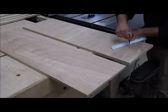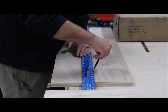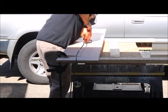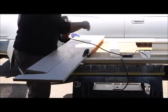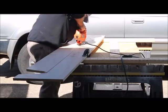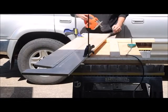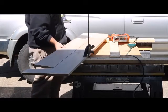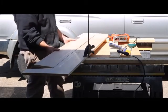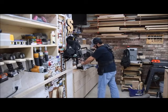I'm going to add some design elements into this bed, making all of it out of plywood. I'm adding in some angled legs — I'll cut out all of these sides and ends with a jigsaw to give me my leg profile. One thing I learned through this whole process was that I needed to just trust the jigsaw and let it do the work. I tried to rush a couple of cuts and my blade started wandering — you just have to let the blade do the work and guide it along the path.